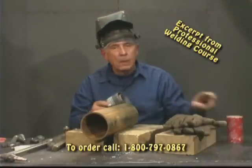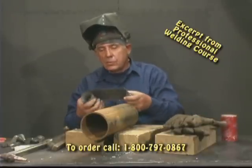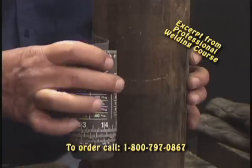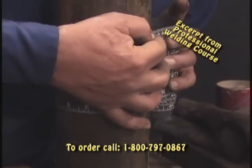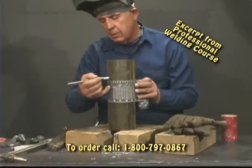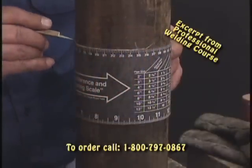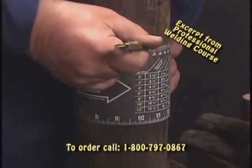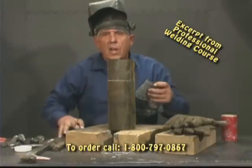All you do is wrap it back up, put it back in your container, and it'll be ready for you the next time. Let me just wrap this up — turn this here in place, bring my wraparound around, line up my edges right here, pull it tight on your wraparound, make your mark, come around the pipe. That will give you a nice straight line to cut on.